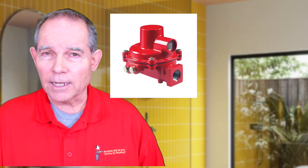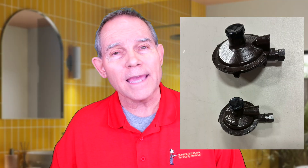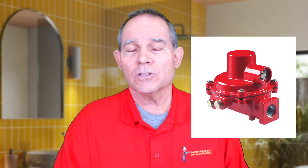We said that you can identify it by the regulators. You have two kinds of regulators on propane systems: you have a first stage regulator, which is at the tank generally, and then you have a second stage regulator, which is usually where the gas goes into the house. Remember, this is liquefied propane, not natural gas. If you'll notice on the pictures that I've got, the first stage regulators are red. They're smaller regulators usually, and these are regulating the pressure from the tank to the line in the yard.